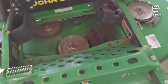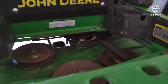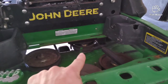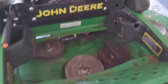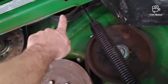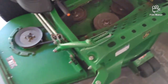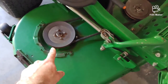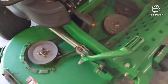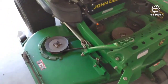The pulleys don't have grease fittings, and the belt tensioner idlers don't take grease fittings — those bearings are permanently sealed. These spindles cost about $150 and up to replace just for the part, not including labor. So you need to grease these — probably a couple of pumps every day.